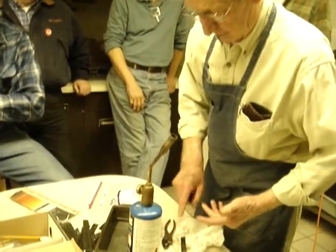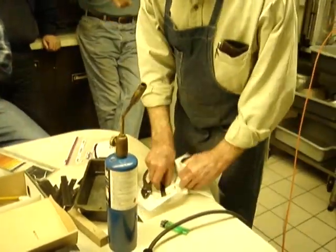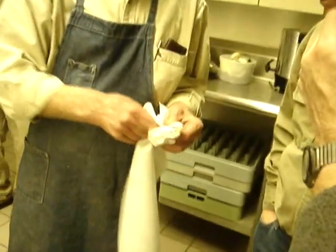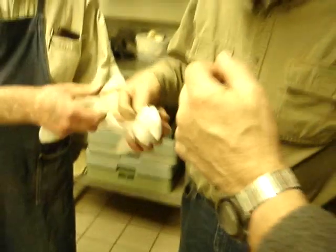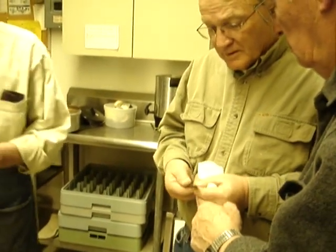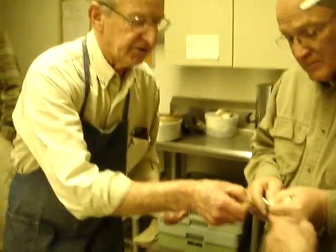Yeah. This one here right now, I can tell you, is glass hard. One way you can tell is if you look at that frosty silver color. Let me just pass it around. It's oily. Is that good? That's what you want? Yeah. It kind of has a pattern in it. Well, it's not so much the pattern as I'm kind of guesstimating by the color.